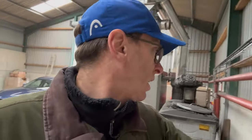So I don't know, can we raise it up? I'm going to have to do a little bit of tweaking, see if we can get a little bit more power out of her. The fan outside is running at half power basically, so that sort of makes sense because the heat exchanger is a 250 heat exchanger, and that's running half power, so that all kind of figures in. It'd be nice to get it running on full power.